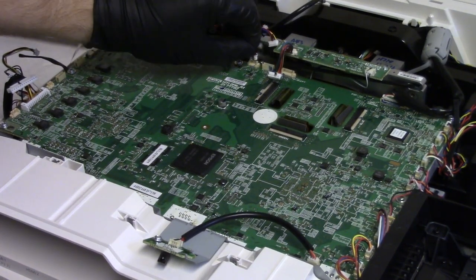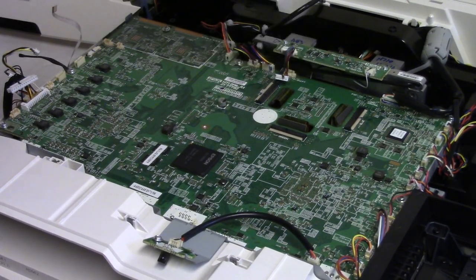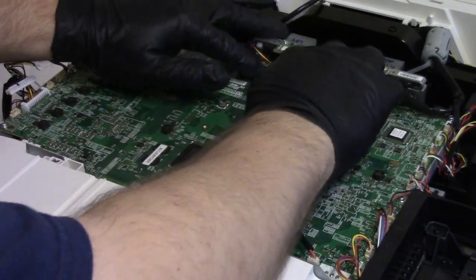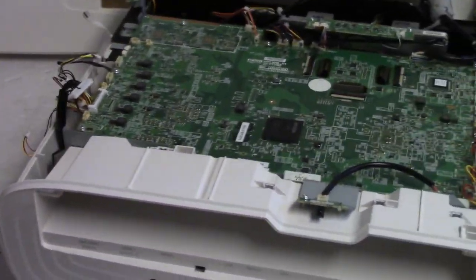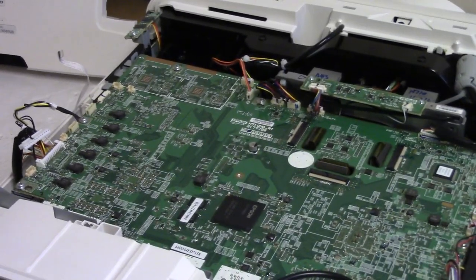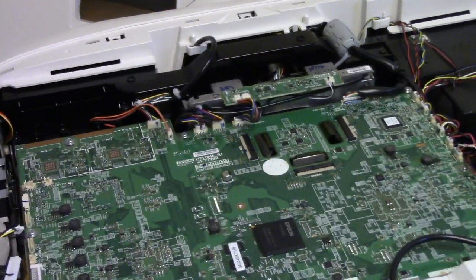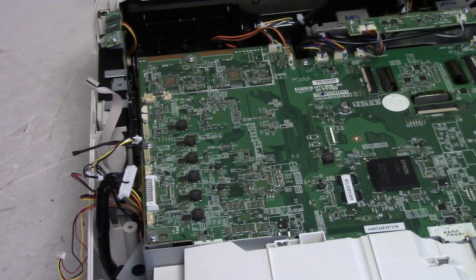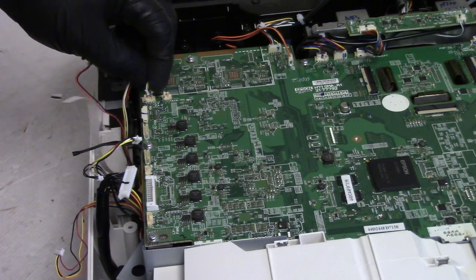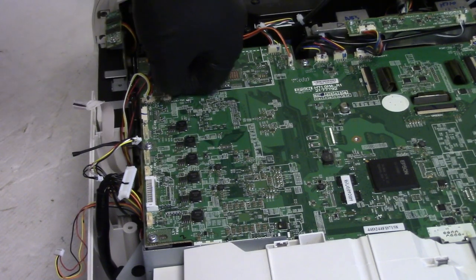You know, I was wondering if it was something with the front panel, maybe a video mute. So I even hooked up the network to this, using the LAN connector in the back, and I used Projector Link software to talk to it. And the PJLink stuff even said that it wasn't on video mute and that it should be working. And it wasn't. So that was when I knew that my no good, very bad day was going to get even worse.